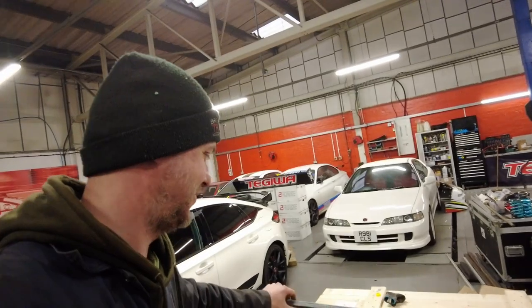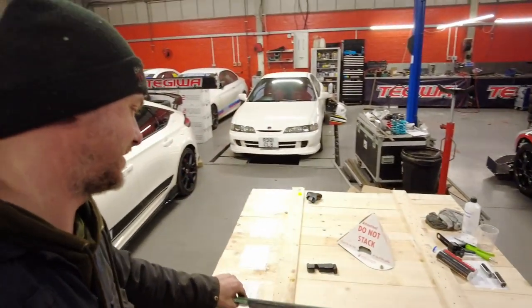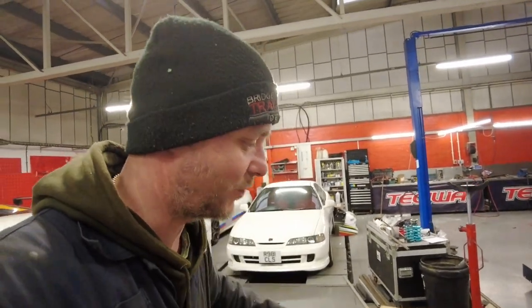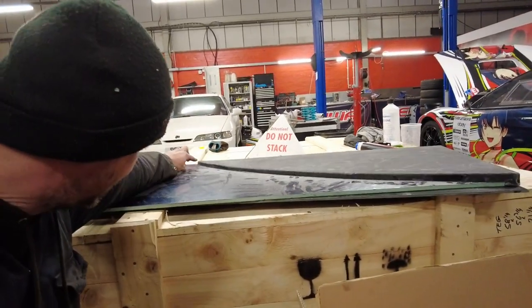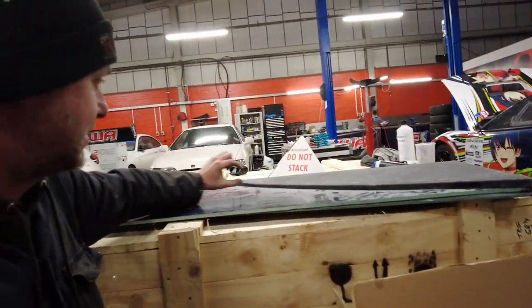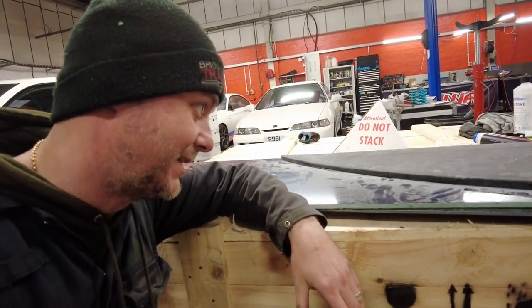So you're probably asking, what was this effort for? What sort of aero part was I making? This. It's difficult to explain what this is, but this effectively is a side skirt, side plate, whatnot. The reason why it had to be of this weird shape is because it's all about aero. And as you can see here, you have 10 mil going into 20 mil. So it's a bit of a widening mouth thing, directing air to certain parts of the diffuser.